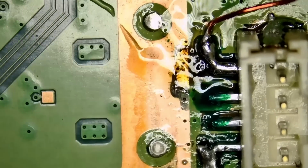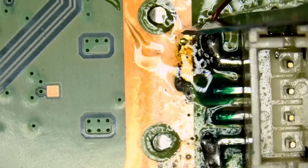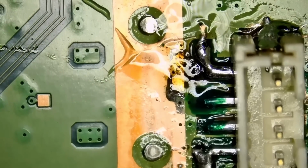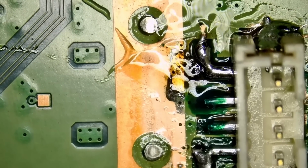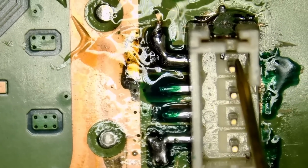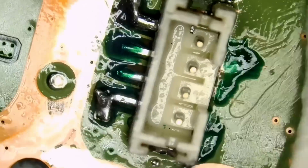And now we can cut that wire. We're gonna measure again, make sure we have a diode reading. And we're gonna measure at the pin. Perfect. We do not need to mask any further. Everything is good. So hopefully this time it works, and I'll be back.